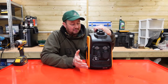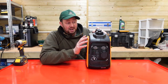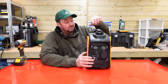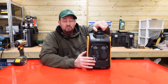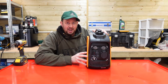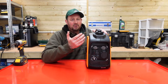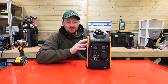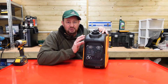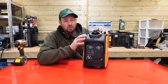The first thing to check when you're having trouble starting one of these inverter generators is the fuel. We run these on super unleaded — a few pence extra, but it does make a difference. We've got a vapour lock on here which actually prolongs the life of the fuel; if you turn that to closed when the machine is sat not working, it stops the vapours escaping. Because these are small engines, they're quite finicky about the fuel. If you've had fuel in here for a couple of months — loads of people buy these as an emergency backup or use them sporadically — it's best to take that fuel out and put fresh fuel in. Try to measure it and run it out of fuel when you're using it; it will work a lot better that way.